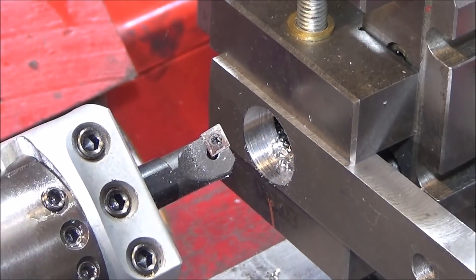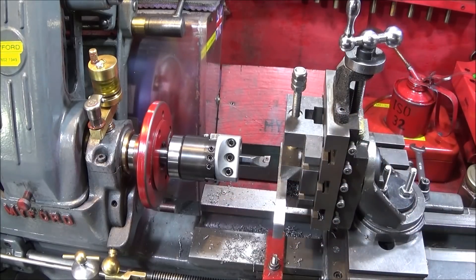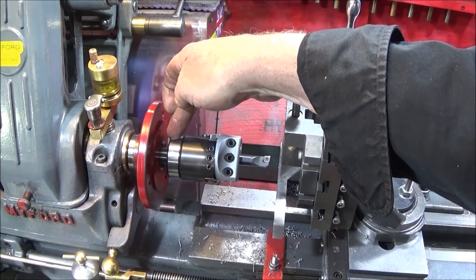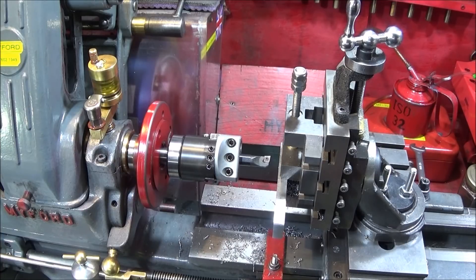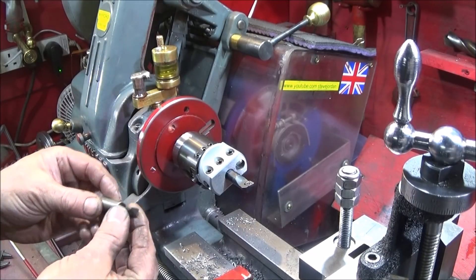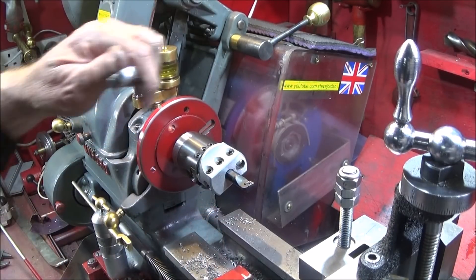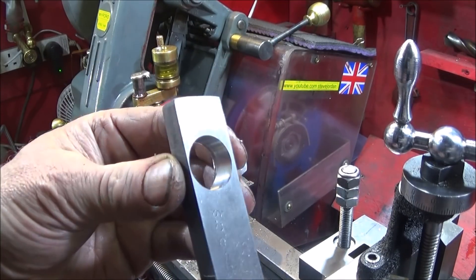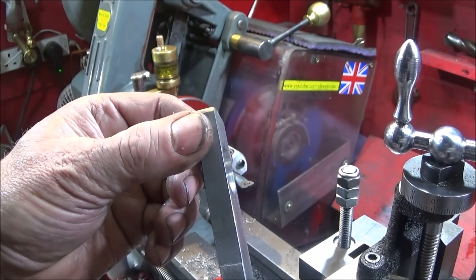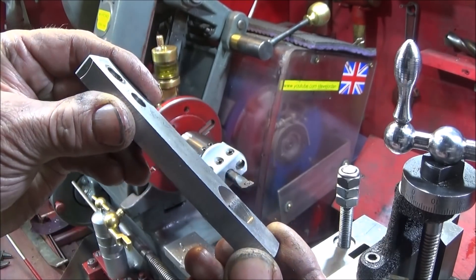There was a bit of chatter on that forward cut, but a lovely finish on the reverse — and that proves it's a really good tool. I'm really pleased with this 50mm boring head. I could have used it for many jobs I've done in the past, and I'm going to get the MT3 adapter so I can use it on the Chinese mini lathe as well. This type of insert tooling is excellent when cut down for use with the boring head, and the small brazed boring bars are brilliant for very small bores. The test piece shows a lovely finish — for mild steel it's not the best material to get a good finish in, so I'm very pleased with that tool.